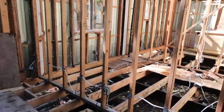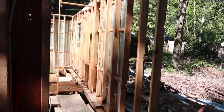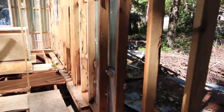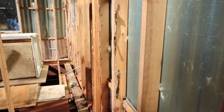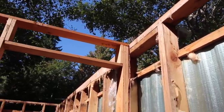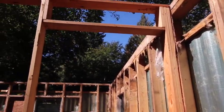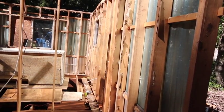What I'm going to be doing today is framing up some walls. I'm going to start here and go back around, and originally I was just going to take the rotten studs out one at a time and replace them, which I did at the opposite end of the house. But looking at them, there's really only like four or five that are salvageable. The top plate looks good from the bottom but on the top side there are a few soft spots, and the far side is mostly all rotten. So being that all the studs are bad for the most part and the top plates aren't that good, I'm just gonna start fresh and frame up the full wall, then take each section out at a time and replace it.